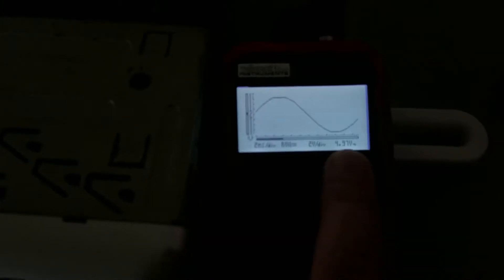Right now with plus two it's perfectly clean at four volts. If I go to plus three, I have to change my resolution — it changed down to one volt, so I changed it to two. Now it shows 4.97, but you can see a clip at the top and bottom. Lowering the volume one click takes me down to 4.49 clean.